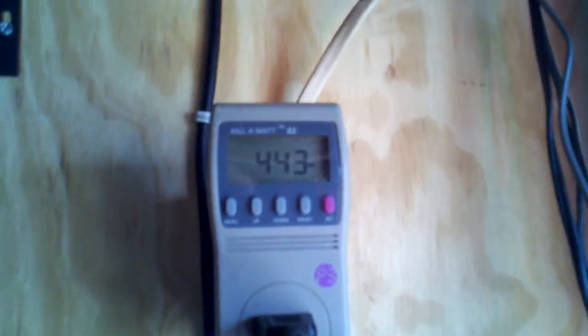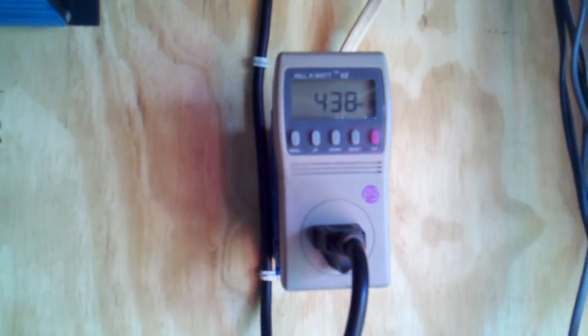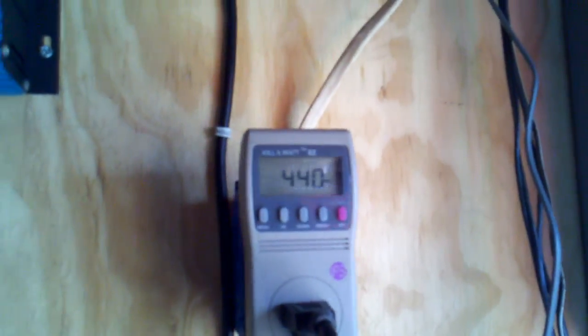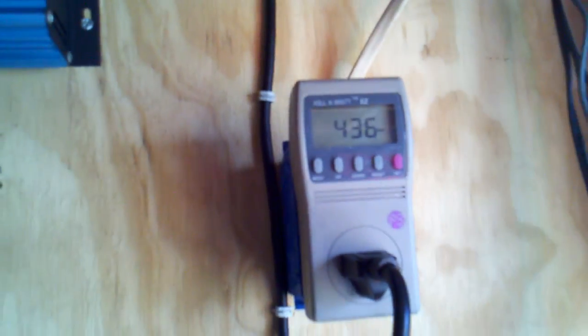Hopefully the meter doesn't count going forward. I'm going to do a test when I have more time and a good period of sun — I just wanted to get these panels producing as much as I could before that test. That way, if I'm running 500 watts for two hours straight, I know I've made one kilowatt-hour and I can see if the meter moved. But I've got to shut everything down in the house to do that, except for the one leg feeding out to the shed, and make sure all my loads are off.